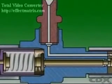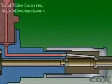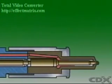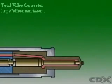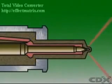The injection pump delivers fuel to the injector. The fuel passes through a drilling in the nozzle body to a chamber above where the needle valve seats in the nozzle assembly. As fuel pressure in the injector gallery rises, it acts on the tapered shoulder of the needle valve, increasing the pressure until it overcomes the force from the spring.